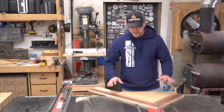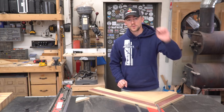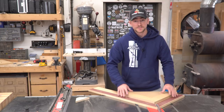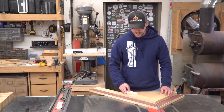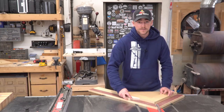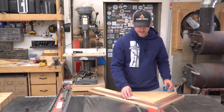The sandpaper I just glued on here is actually an old remnant piece from a belt that broke on my drum sander. It works really well to keep that kind of stuff around so you can hack it up and use it for jigs like this. In this case it adds a lot of grip, because on smooth MDF your work piece is just going to slide around a lot, but on top of that sandpaper it's not going anywhere — so it's a lot safer and a lot more precise to use it that way.